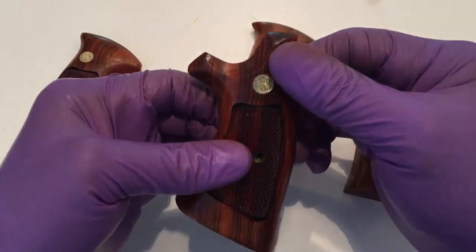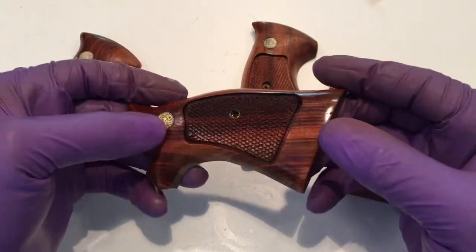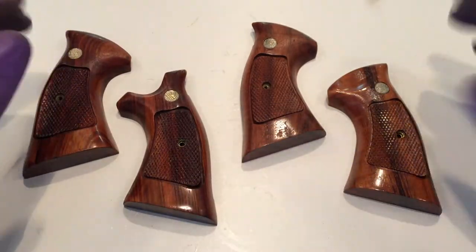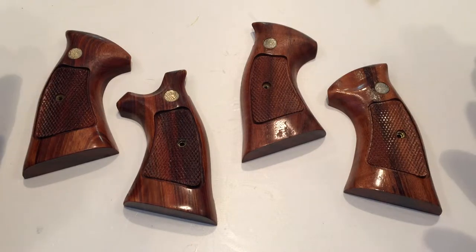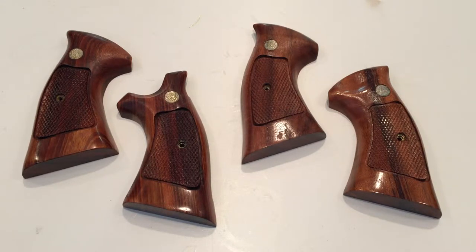What I'll usually do is remove them either with a coarse paper towel, or my preference is to wet sand them off. I use 1500 grit thoroughly wetted sandpaper. That'll get them pretty dust-free and give you a smooth surface again, yet it won't remove any of the previously applied coats of poly. All you want to do is wipe them off to get rid of the dust, make sure they're clean and dry, and then you're ready to put on your second or subsequent coats.